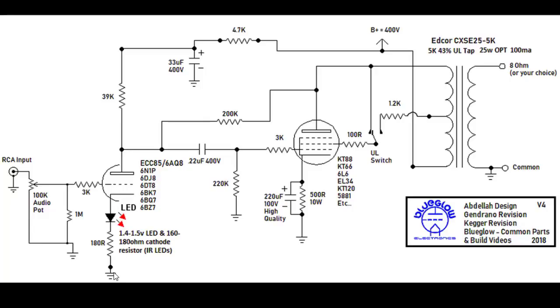So, some other ideas people might have had over time was to use a zener here. You see zeners used a lot to establish screen voltages, but you don't see them used to establish cathode voltages. The reason being, zeners are kind of noisy devices. They're also susceptible to some thermal drift, which is not a good thing when you're working inside of an environment that you're intentionally heating up. Vacuum tubes get pretty warm.